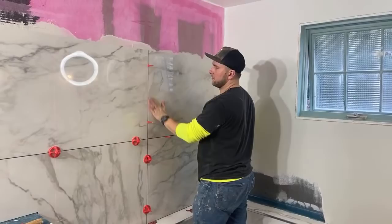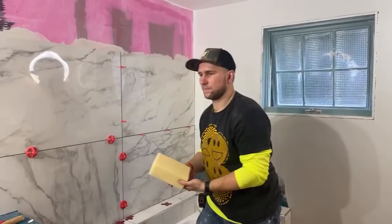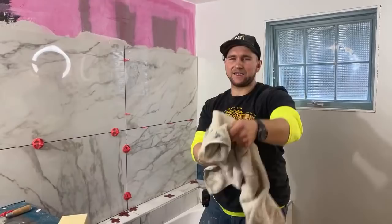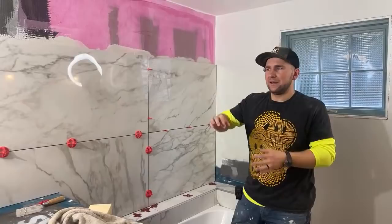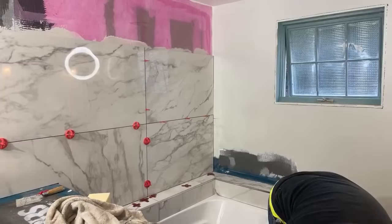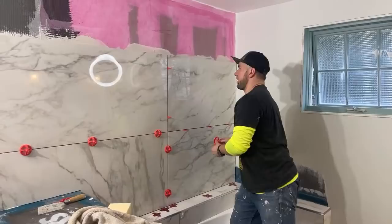Michael, do you guys float your shower walls? We don't. I don't really know how to do it right off the bat. That's the first thing. But second, I have a little bit of carpentry background. So to me, it's just easier to reframe that wall, sister it, shim it, or rip pieces of wood and fix it that way. I just feel like it's much easier than trying to float it. I know some people are so good at it, but I'm not. So I guess keeping to my strengths.